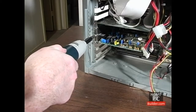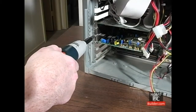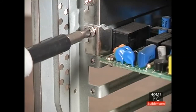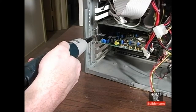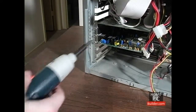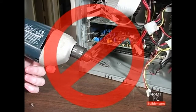When using a power screwdriver, be careful not to over-tighten the screws. It's easy to strip the threads, which can ruin the part. If you do strip the threads, try using another screw with bigger threads in the hole. To reduce the likelihood of this happening, hold the power driver very loosely so when the screw is tight, the driver will slip in your hand. Under no circumstances, use a power drill with a screwdriver adapter.